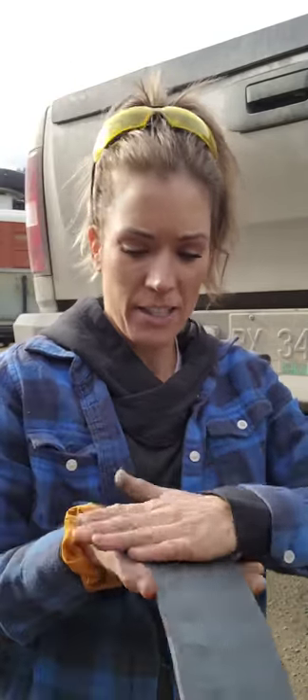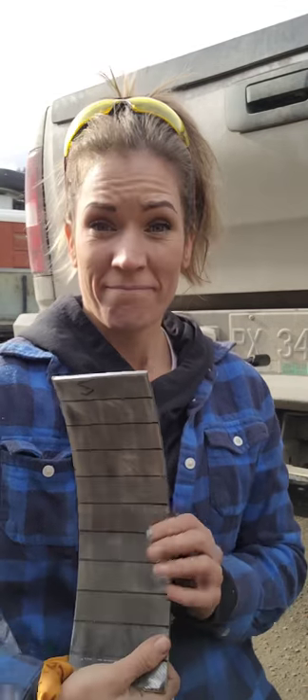Now I have the perfect little curve, and I have two that I'm going to do for each one. It does have a bit of bumps on the ends or on the outsides, but I take a nice flapper disc and just buff that up — it takes off all the mill scale on the outside edge too. That's how I make my little arches. Now I'm going to go finish making my brackets and show you guys what they look like.